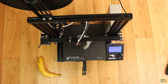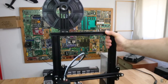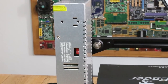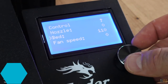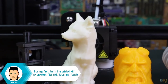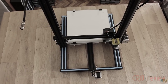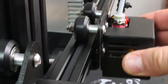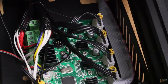I really recommend this printer for both beginners and those looking for a new printer. It has a strong metal frame and is very compact, so no loose cables or external cases. The 24V power supply means the bed heats up quickly and reaches around 110 degrees, making it better for ABS and nylon prints — something the CR10 struggles with since its large bed is slower and can't really exceed 85 degrees. All axes of the Ender 3 have V-rollers and move very smoothly. The electronics are inside a metal case below the machine, and the fan is not that loud.